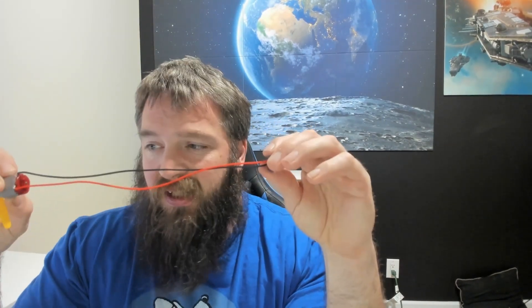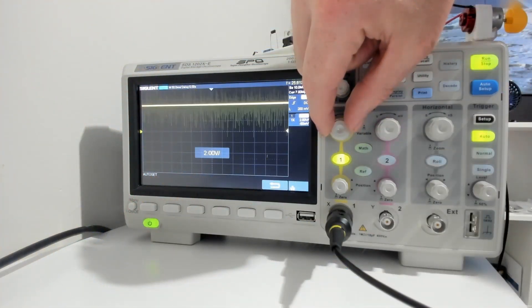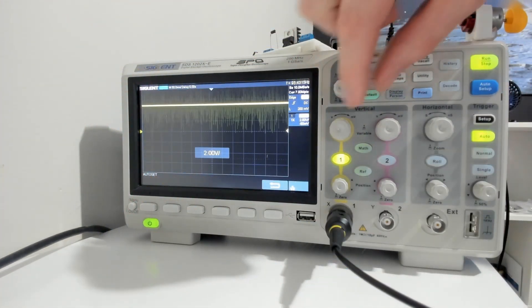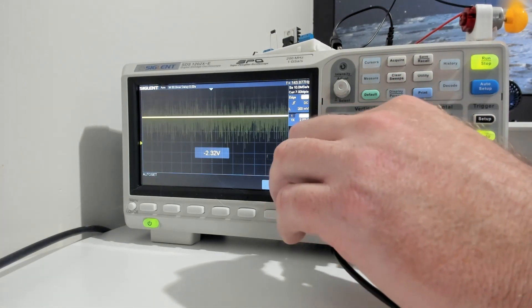Because of the motor running, we're going to take the default configuration of the motor — no caps, just the wires — and the default configuration of the 5-volt regulator, and we're going to see what happens. Looking at the oscilloscope, you can clearly see that there's a lot of noise within the system. We're going to have to clean that up in order for it to work properly.